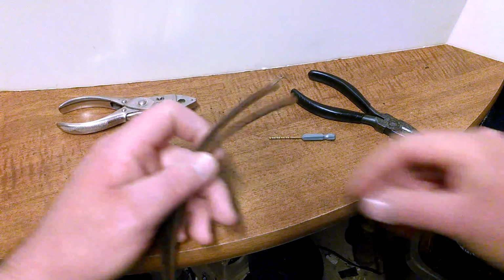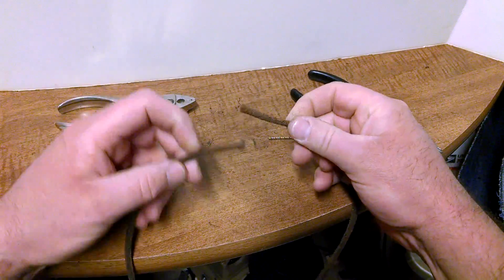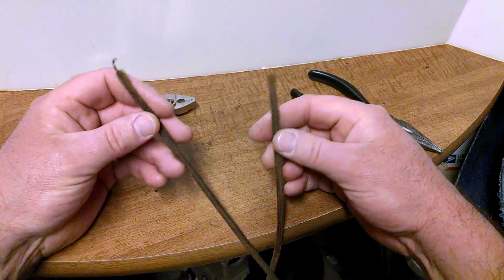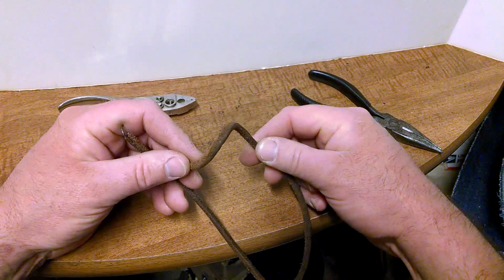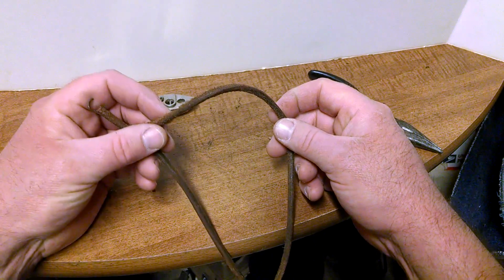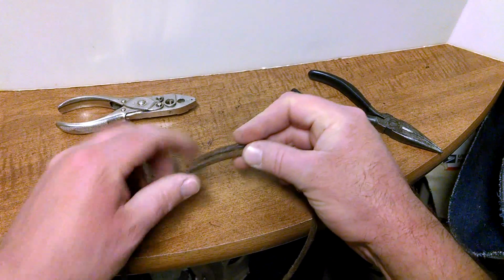I want to make this video showing how to splice the ends of a treadle cord, and I'm not going to have it on the machine, basically just so you can view what's going on. When you put it on the machine, the obvious things, you wrap your cord around the flywheel and around the groove on the balance wheel on the machine, and you pull both ends tight